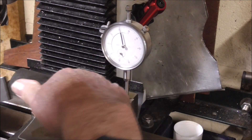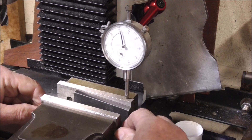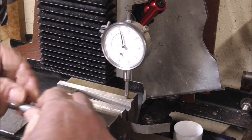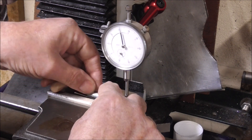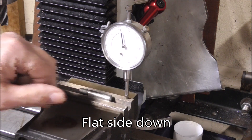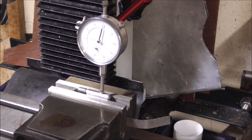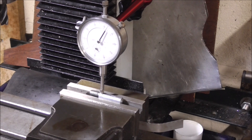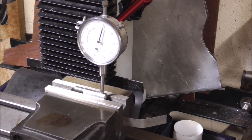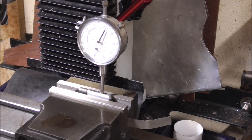The next thing I do is put this little plate I've made in — it sits there nicely with a spring to hold it in place. Then I pop the cotter pin in — this is the one I bought from George Pru — and I'm now going to set the dial test indicator across the cotter pin. When I run the bed of the mill across, you can see there's very, very little movement — probably a thou maybe — so I'm quite happy to mill it at that angle now.